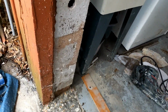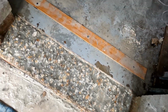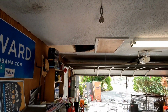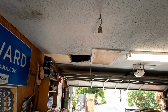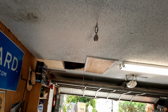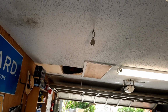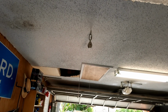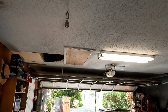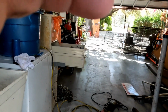So I'm gonna clean up these corners just a little bit, but I've got enough out of here, and we're good, because I'm gonna pin it to this beam at the top, because the top is usually really level, and that's what I'm gonna do. I'm gonna put the frame in once I get the width right, and I'll jack it up and throw a couple of Tapcons into that beam, and then hang the rest of the door, get it squared up. So that's the plan, man.